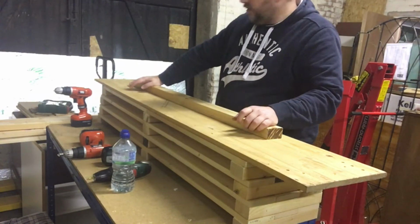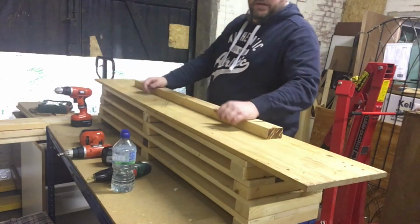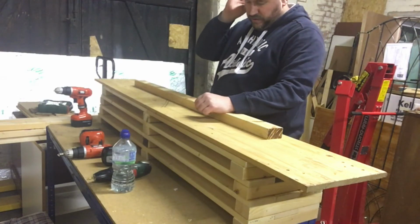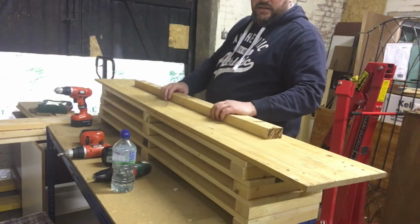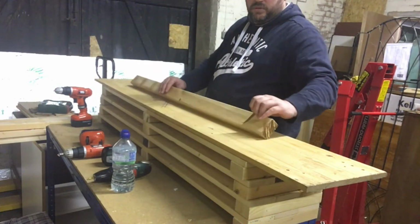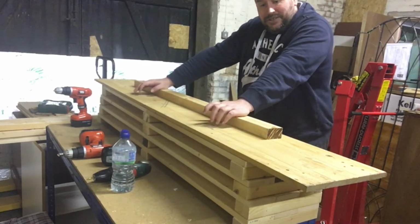It also means that on this top piece, on either end, there's quite a few holes. I think there's what, six drill holes there. There's four on this end. So what it means is I can actually come in a little bit from each end and give myself a nice clean cut. To be honest, it's what I did with quite a bit of the studding, and even the shelving pieces, took a bit off each end to get a nice clean cut, because I think Steve had cut it with either a jigsaw or a table saw, so some of the cuts weren't clean, which is easily done. If I tried cutting with a jigsaw, it ain't clean. So yeah, that's what I'm going to be trying to do next.